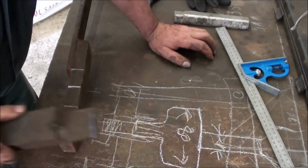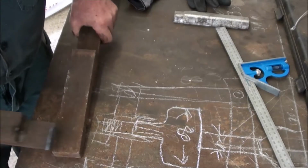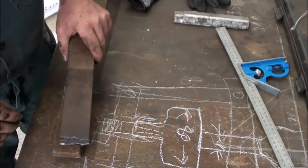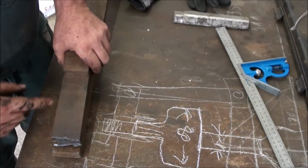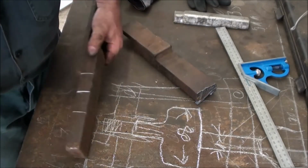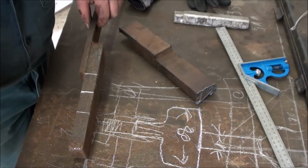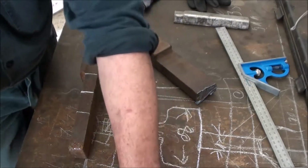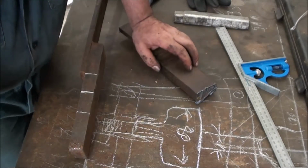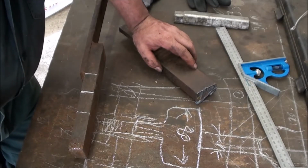That'll give us enough room there, because we end up with a piece of flat bar up here, a piece of flat bar up there. We'll put this on the other side. We'll drill a couple of holes through it. It's 25 mil, it's ridiculously robust for what we're doing. We'll use this bit of 10 mil, I think it is. Looks like 10 mil. Yeah, we'll use this bit of 10 mil, we'll halve that. We won't even halve it, we'll end up with less than half, but we'll get a couple of 200 mil sections out of that.